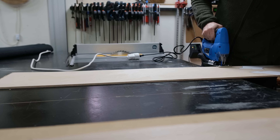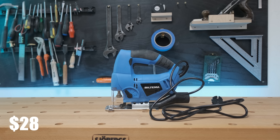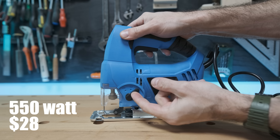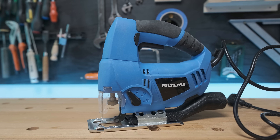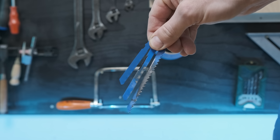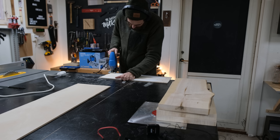The wood has been pre-milled because a jointer or thicknesser wouldn't fit the budget, but you can buy pre-milled wood as well. The first tool I got to use was the jigsaw — this one was $28. It's a 550-watt jigsaw with an RPM of up to 2800. It has a lock button for continuous cutting, a grade scale, and came with three blades: one for wood, one for metal, and one for plastic. Inserting the blade was actually very easy.